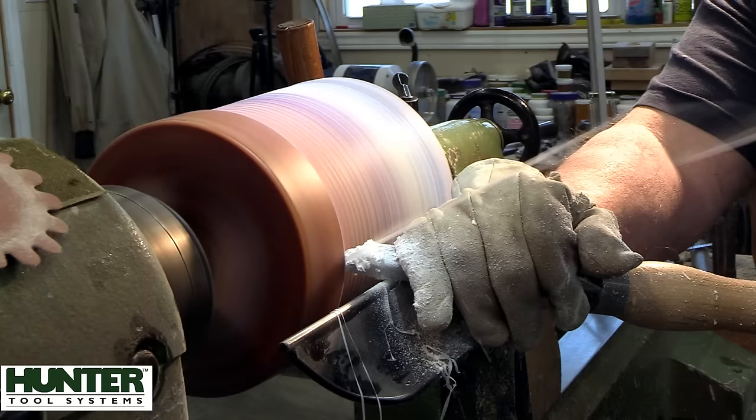I could have tapped this and tried to screw this in, but I figured that it was probably best not to do that. That is, as you can see, a very long brad point bit. I got a set of, I don't know, maybe 6 or 8 of these from Princess Auto that are this length, and they're not the best of quality. I've actually untwisted 2 smaller ones, so here I'm going really slow to make sure that doesn't happen. So in the end we get it, and that's the important thing.